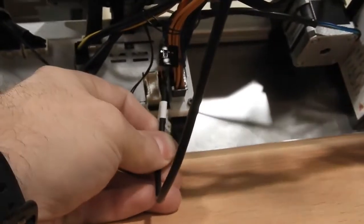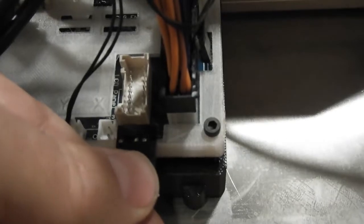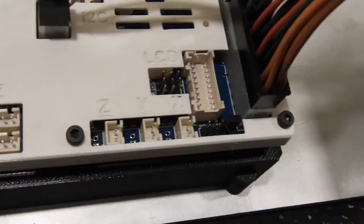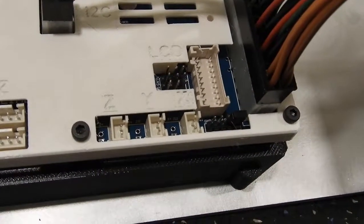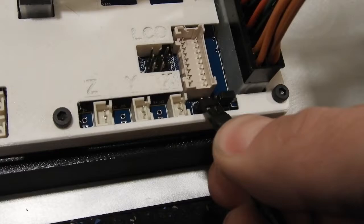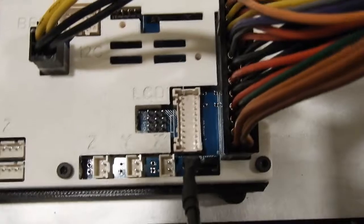Connect the other end of the micro USB power cable with the silver connectors facing to the top of the printer, and for the 4E3D mainboard, install the red lead all the way to the left on the power pins on the mainboard as shown here. For the ReliaBuild3D board, also install the cable with the silver connectors facing up all the way to the left. This will leave an empty slot between the cable and the power enable jumper.